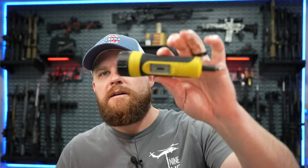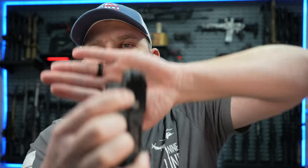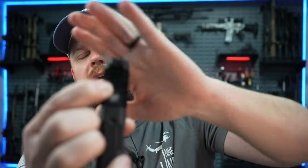We'll go over a few things you might want to look for and see how well it co-witnesses. I've got a set of Wheeler Torx wrenches and Allen wrenches. I also got a Wheeler Fat Wrench torque wrench in inch pounds that I'll torque this down with. If you want to check out any of the tools, plates, or the red dot, I'll leave a link down below in the description to our website. I'll use a T10 Torx driver to pull the cover plate off the back of the slide. Here's the adapter plate from C&H Precision — I'll set it down in there. It locks right in on the lugs machined into the slide and sits nice and flat with not much height to it at all. Then you take your EPS carry, set it on, make sure it locks down in those recoil lugs, and put the new screws in that came with the adapter plate.